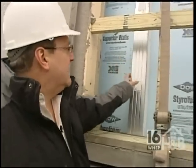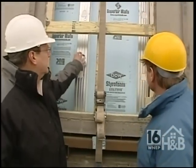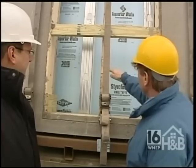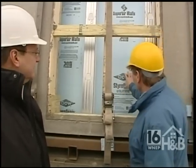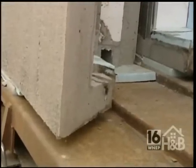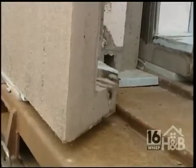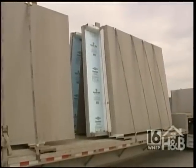Now you can. And this is where you would hang the drywall. And they're set, in this case, because it's so strong with the concrete, 24 inches, and the concrete wall's behind this, and there's little holes where you can run your wires, because no one wants to drill through concrete, do they? That's the last thing in the world. No, it's all ready to go. And it's a thick wall, though, isn't it? My goodness, that's what, 10 inches? 10.25. With all this rebar in here and steel and a good quality mix, you've got something that's going to last an absolute lifetime, if not several lifetimes.